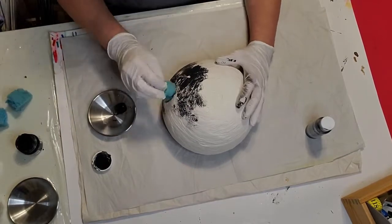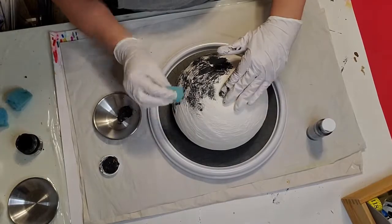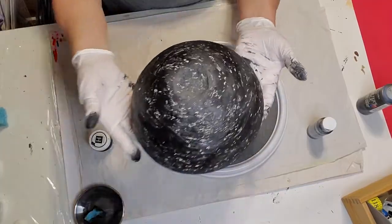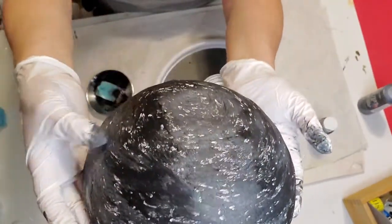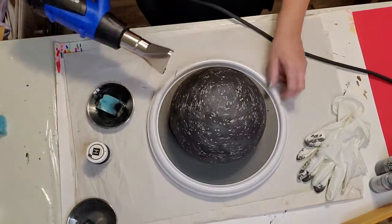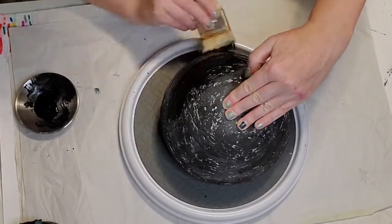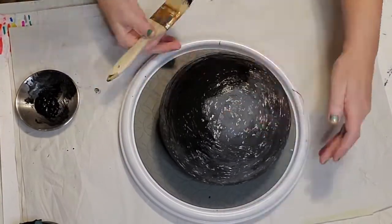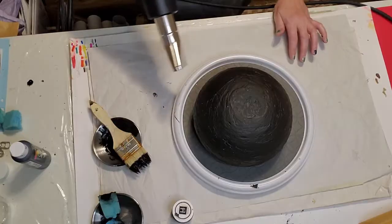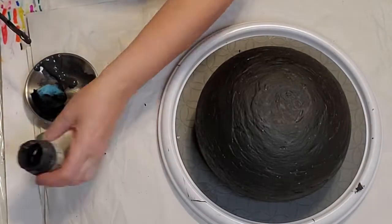Now I'm using a Fusion color called Ash — a charcoal color — and some black. I started out with the black, sponging it on. Now with the last bowl I used a brush first because I didn't want any white speckling to come through — you can see how that white still comes through with just sponging. So if you don't want that, start with a brush. I dried it up with a heat gun — if you have a heat gun you can use it to speed up your drying process. Then I used my chip brush and went back over it with the black to cover up all that white that was showing through, because I want it to look old. Dried that up — you can see it's dry because it's matte looking now.